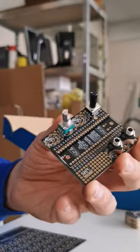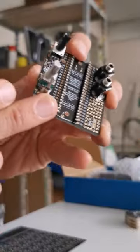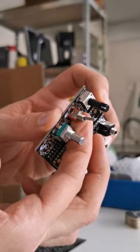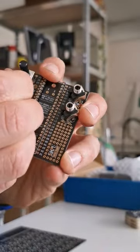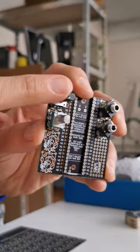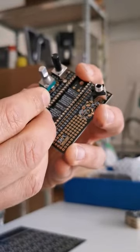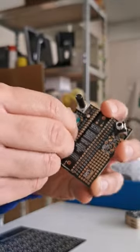These are the different components we can connect on the footprint. As you can see, the switch is going to be connected in the center just like that, but you could also put a potentiometer wherever you want, or a trimmer, or a jack socket at 45 degrees. In a sense, you could design your own interface.